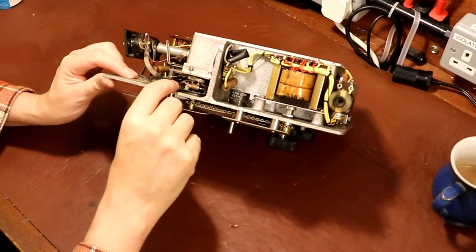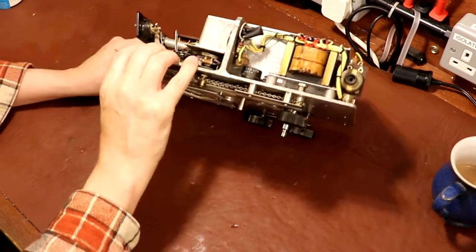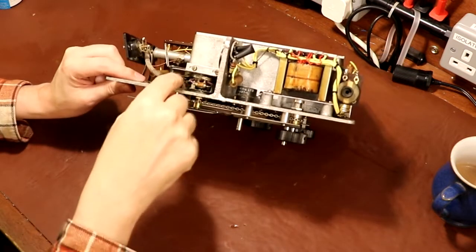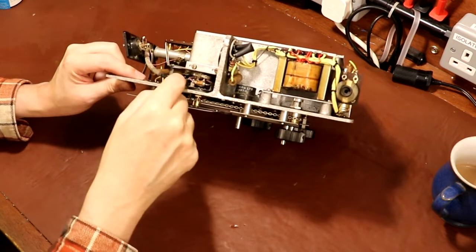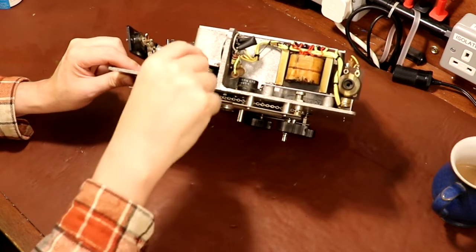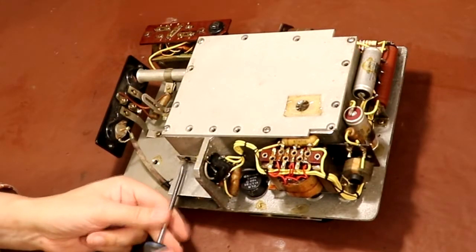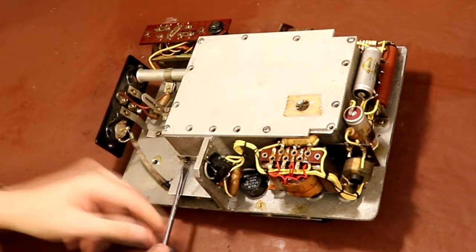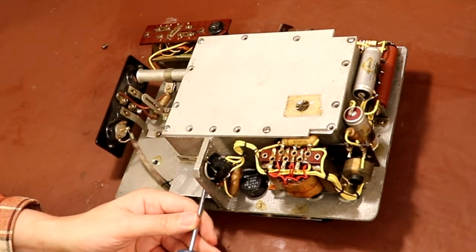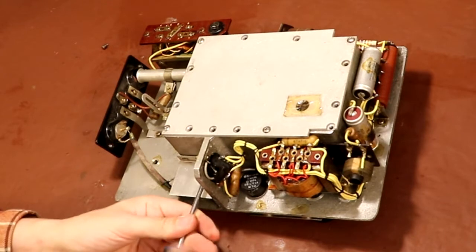I've just spotted here that we've had a little fire in this piece of equipment. There's a resistor connected to the RF output here — it's got a little coaxial cable and then there's a resistor going on to a switch — and this resistor that joins the inner core of the coaxial signal cable has had a little fire. Let me just take this metal cover off and I'll be able to show you. I think at the beginning of this video I probably uttered those famous last words about this only being a ten minute job to recommission. But with any piece of equipment, when you actually start digging into it, you always find far more problems than you were expecting. And to be honest, we wouldn't have it any other way, would we?